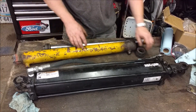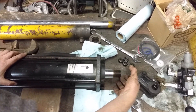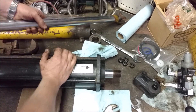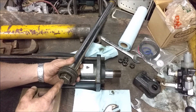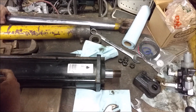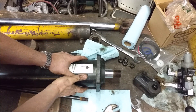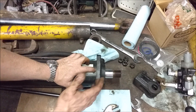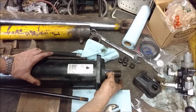Let's take this one apart and do the seals. I've got my clevis screwed off. Now I'm able to actually pull my seals right off the top, whereas with a welded-on clevis you're not able to do that — you'd have to take off the bottom nut. Those bottom nuts are torqued on there good. They need to be around 500 foot-pounds; this one's 463, but they're all around there for a four-inch cylinder. A five-inch cylinder is probably around 1,200 foot-pounds. I'm going to try to just take off the top without disturbing the other end, since it's a tie rod cylinder with seals on both end plates and the bottom end isn't leaking.